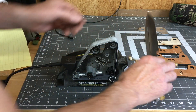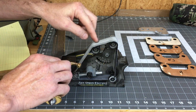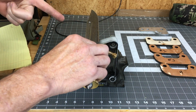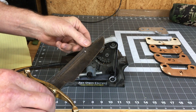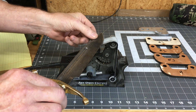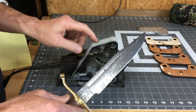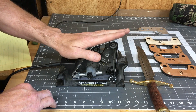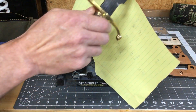I like this better than systems that have a clamp on the blade with a little rod sticking out, because the angle is set by the rod and not by the belt. The rod is set to 20 degrees but as you move across and get farther away it actually changes the angle out towards the tip of the knife. I like this system better — it allows a little bit of freehand control but also keeps a very consistent angle edge. I sharpened this knife with this grinder and it is just hair-splitting sharp.